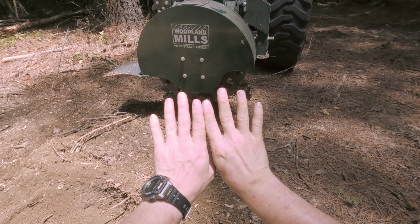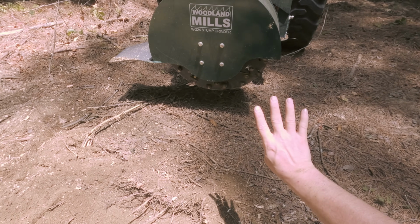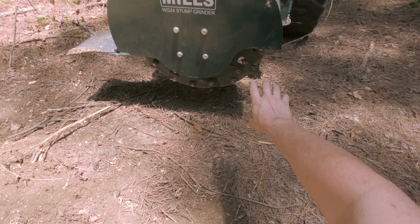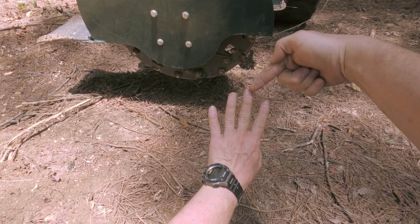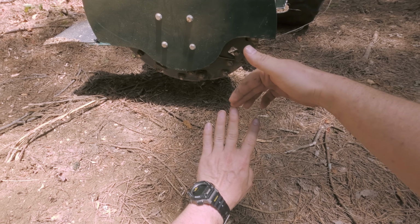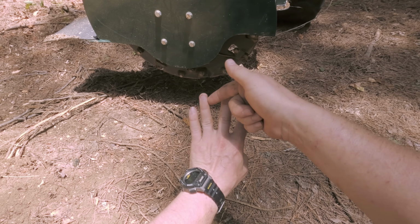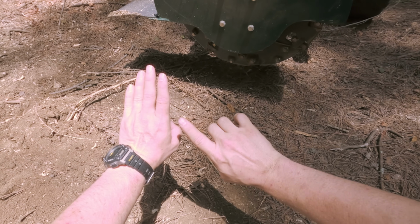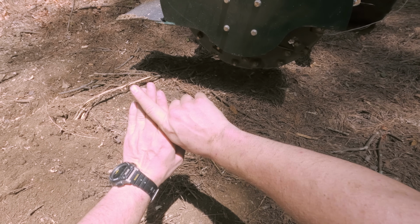And the reason being is if your stump is vertical, obviously all stumps are vertical, then you have wood fibers sticking straight up. Picture a stump right in front of this quadrant, then the teeth of the cutter come down into the top of the wood fibers, and that's a very, very hard cut. It's very aggressive. It makes the fibers want to tear off and chip off more so than if it was cut this way on this quadrant, the slicing cut or the sideways cut.